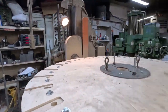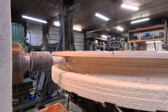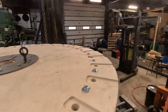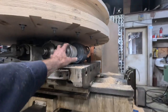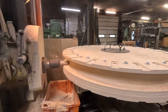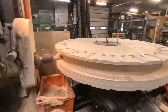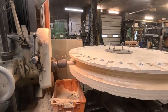I'm having to do something pretty sketchy on this side. For some reason there's a little bit more drag on the rotary table when you spin it the other direction — there's some backlash in some of this mechanism. It's enough extra drag that the VFD will not push-mill it; it stalls out, and by the time I crank the speed up enough to overcome it, it's going too fast. So I am having to climb mill this thing. Thankfully there's little or no backlash in the machine itself, but it's still sketchy because it grabs chunks. Anyway, it's not what I want to be doing but that's what we're doing.